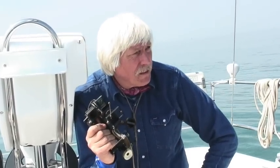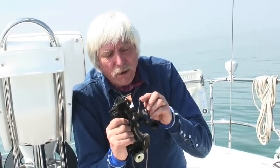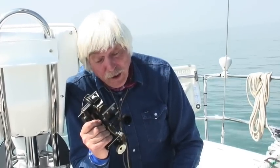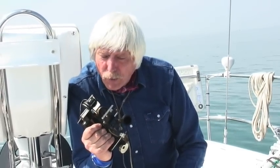Now I've got a problem here because my horizon today is such rubbish that I can't use it. I could use a rooftop, but it would need to be 2 or 3 miles away, and I've got the lovely Cliff of the Needles here, but it's really a little bit close. So there's not much I can do about index error, but I happen to know that my sextant has got almost no index error, maybe 1 minute. So that's that one taken care of. Not a problem with this sextant.